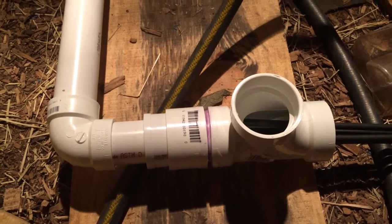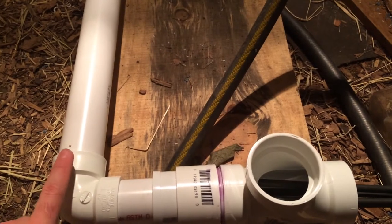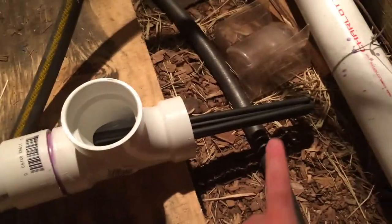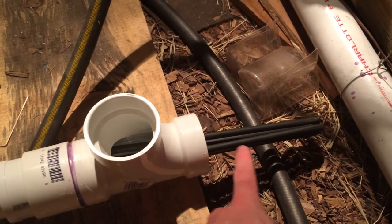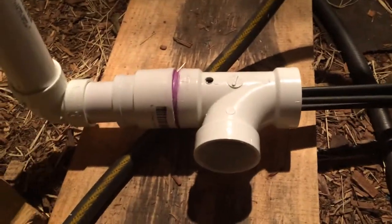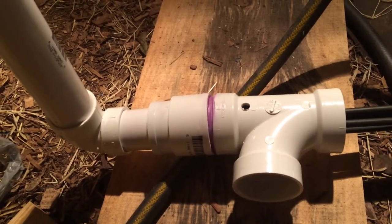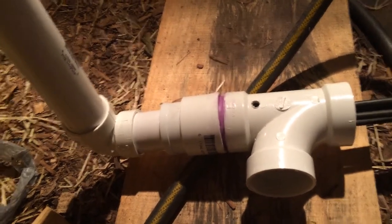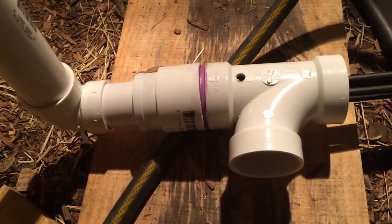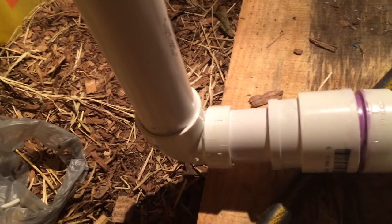Here's the more or less finished product. The wire and all the electrics are completely encased inside the vertical standpipe. In my case, water is going to flow in here from the first sump, through the cross pipe that springs from the first sump to the second sump, flow through here and then flow across. This is going to be stood up vertical just like this. Water is always wanting to equalize — since the pump is pulling out of the second sump, water always wants to flow from the first sump into the second. None of this is glued up yet because I've got to get my electric grease and fix up the wires inside first.